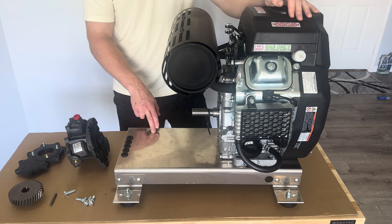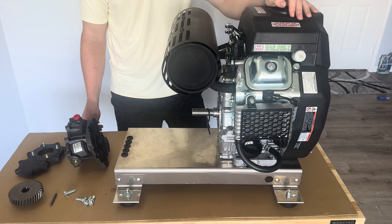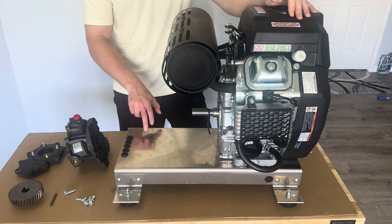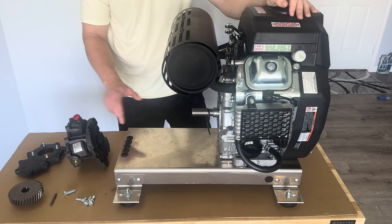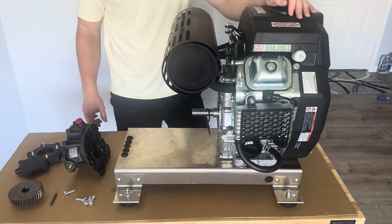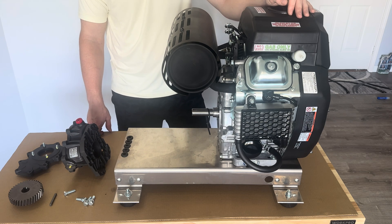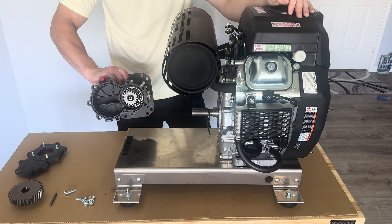I paired this with a KCA 077 skid from Pressure Pro, purchased through SLE Equipment, which I'll link in the description. This particular skid is aluminum, so we don't have to worry about rust, and it's designed for the gear drive, which is what we'll be using. I didn't want to do the belt drive because of potential issues with misalignment, belt tension, and a belt shearing off in the middle of a job. I've run gear drives in the past and they're pretty much dead reliable.